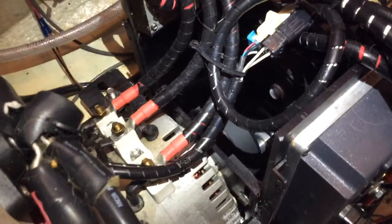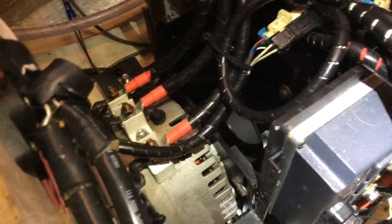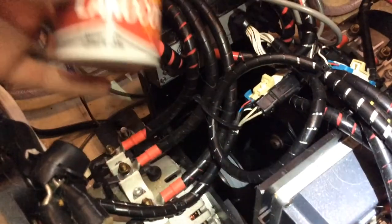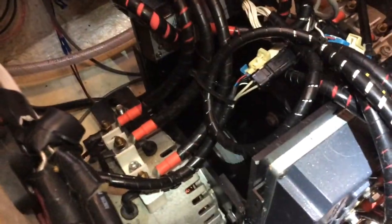This electric motor was completely underwater for several hours and it's still running. I could not say the same if this were a diesel — we'd be looking at a huge repair bill and possibly an entire rebuild. With this electric motor I just used some Lanacote that I already had from rigging jobs, put it in through the plugs, and now it's running.